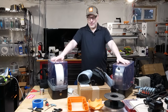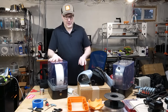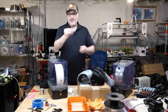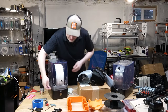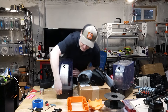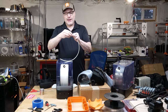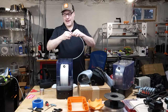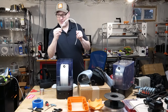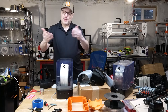The way I have my printer set up is I have the Polybox on top of an enclosure. Not everyone has enclosures — you might just have an open printer. What I've done is use these extra PTFE fittings from our 3D printers. You can use those fittings, but they tend to pop out, so I have a better option — an M6 wingnut, which does a beautiful job of threading in. By sealing it up using that extra PTFE fitting and some Bowden tube, you can get that filament all the way down to your printer, whether it's open or inside an enclosure.